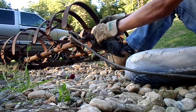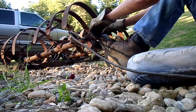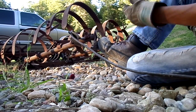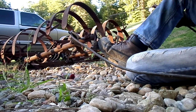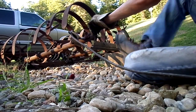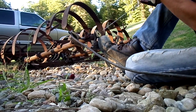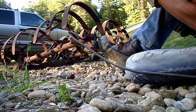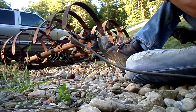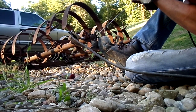My amperage was actually on 90 so I turned it down to 75. It just seems a little bit too low for my liking. There's a better way of doing this but I'm just doing the quickie way.